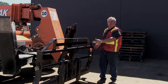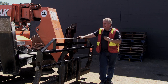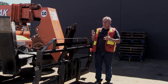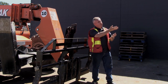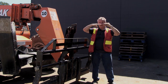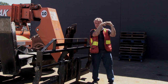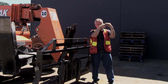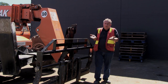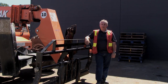I set the outriggers here so that you could see. Normally I wouldn't even have to use the outriggers for moving some empty pallets. But if you're set on riggers, you have to be very, very clearly aware that you can't necessarily move the machine. So that boom angle is very important, and just as important, if not more, when you're coming out of a load. If you want to get out of that load clean, if you could just back the machine up, great — you come straight out. But if you're going to retract, look at the angle of the arm as if it were a boom: as it comes down, it's lowering onto the pallet. So you have to be doing two things at once on the controls — raising the boom and retracting it as you go so that the forks withdraw cleanly. That's a real unique thing about operating a telehandler.